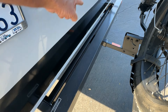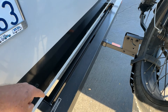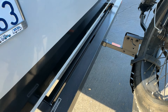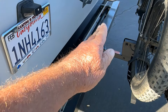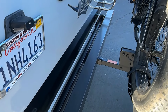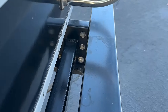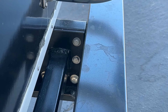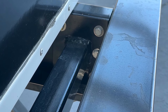So I went with this bar here — it's a tube and it's quarter-inch thick, and it was easy to put in. I had to build it and weld things, so some of you might not have a welder. You can search online and try to find something that'll fit in between this space here. I was very fortunate that this bumper can be removed — most of them are welded in place so you can't remove the bumper, but this bumper has bolts where I can unbolt and remove it.